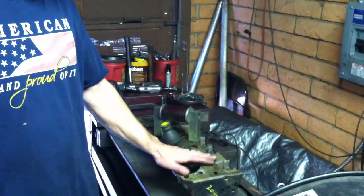But that's magna-fluxing. It's very critical that everything is magna-fluxed. If we had skipped that step on this head and went ahead and done the machine work on it, we would have never found that crack. And the customer or whoever is working on the job puts it back on their car, and the oil pan fills up with antifreeze as soon as you fire it up. That's always a bad thing. So I hope this helps — that is magna-fluxing, and it's very critical that this is done on all cast iron components. We'll talk to you soon.